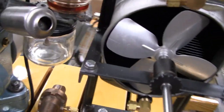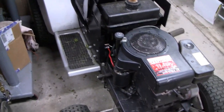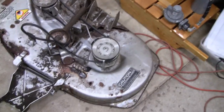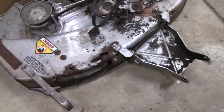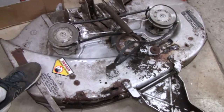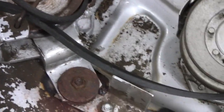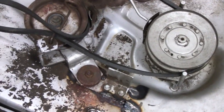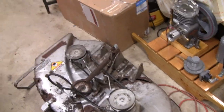We haven't had much time for this — I had to do the valve job on the tractor, then once we got that together we mowed the lawn and came across another problem. This deck is about 32 years old and has a few issues — some rot, even a big rot hole in the front. One part that rotted out created a problem: it was holding the idler pulley that engages the blades, so it threw the blade. I had to put a plate behind that and back it up.